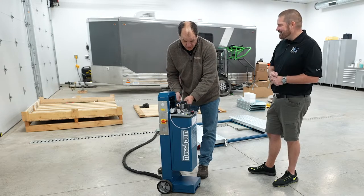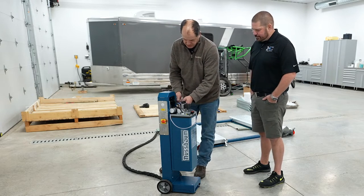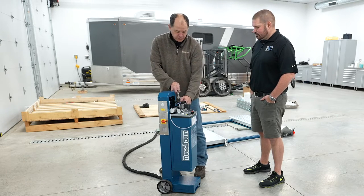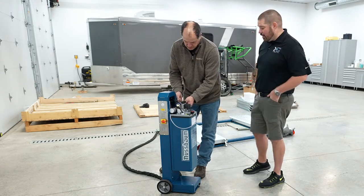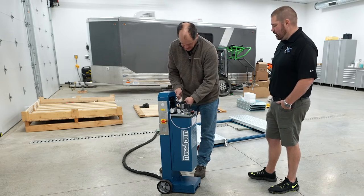But they're always available if someone decides they want them. There are two pipes that come here in this panel. They just have the regular hydraulic quick fittings on them. So it's a matter of taking these off and putting the pipes on. There are two fittings here. You take the ends off, screw the fittings on those ends, and plug them in. So anybody who decided they wanted the quick connects for any reason could always add them afterwards.